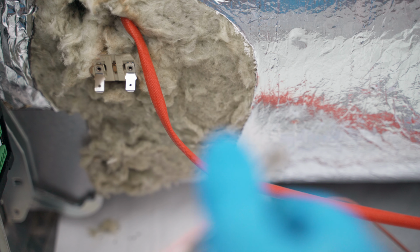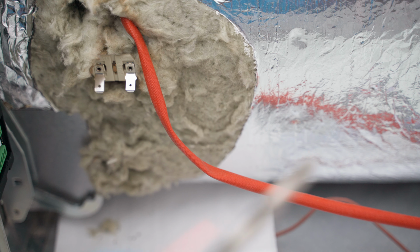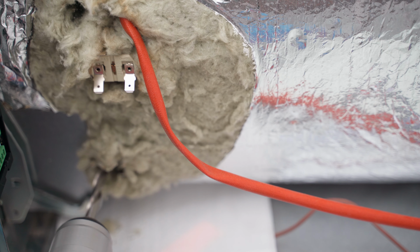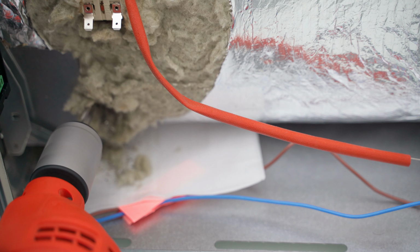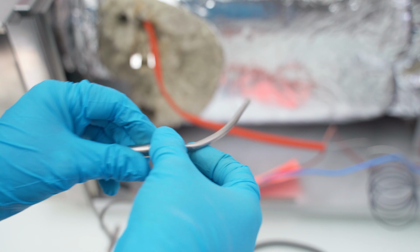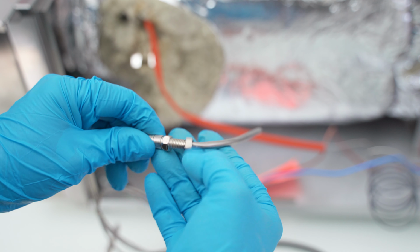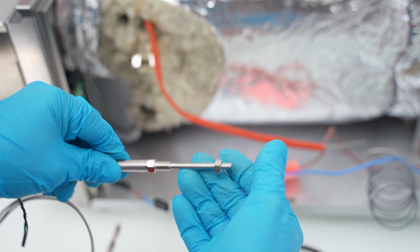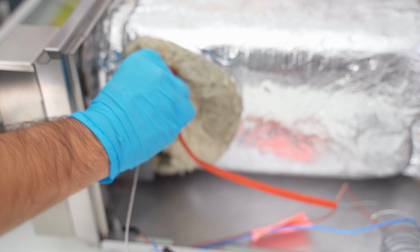Personally, I had no problems for the top one, while for the lower one I had to first use a 6 drill bit, then a 7 bit, and then finally a 7.5 drill bit. Only after that I was able to use the number 8 drill bit. Then we take the two thermocouples as mentioned. The 90 degrees one will be positioned above: unscrew the bolts applied, insert the probe in the enlarged hole, and then fix the nut inside the oven, tightening it as much as possible.